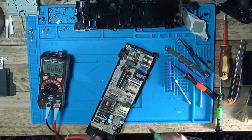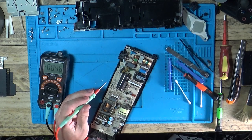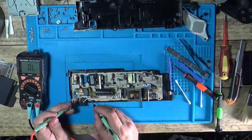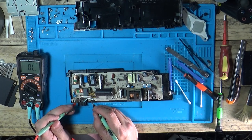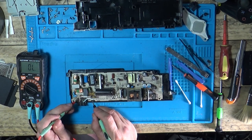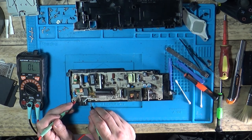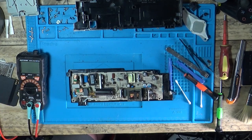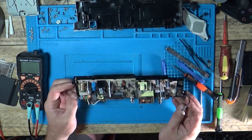Let's check the DC power — what are you reading? One volt. One volt, we should be all right. So if that's got one volt in it, our fuse should be all right. Hello — our fuse has blown. Got the meter in continuity and our fuse down here — that's gone by the look of it. Why has it blown? A short somewhere? I don't know.